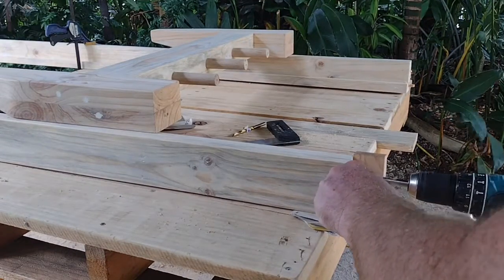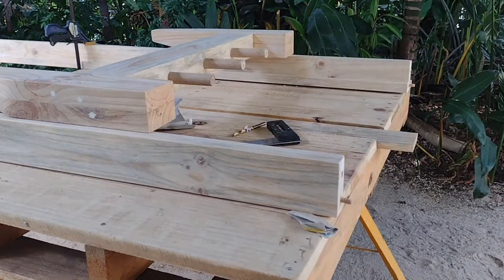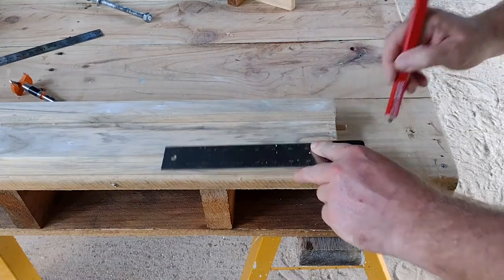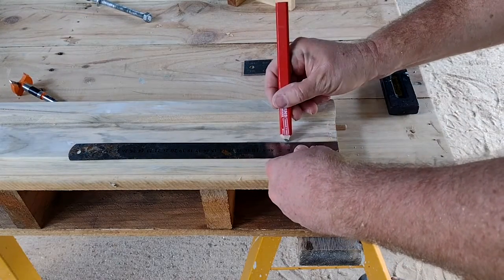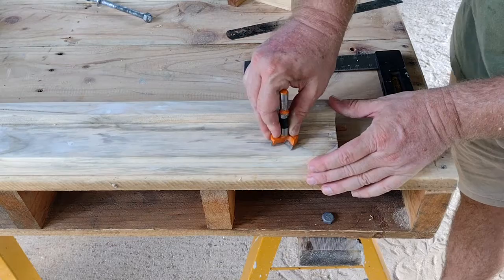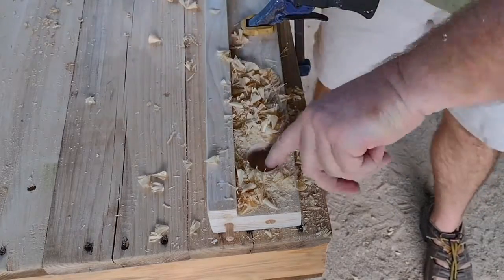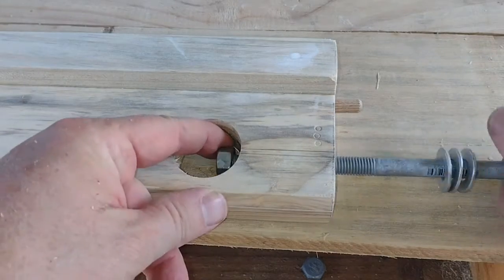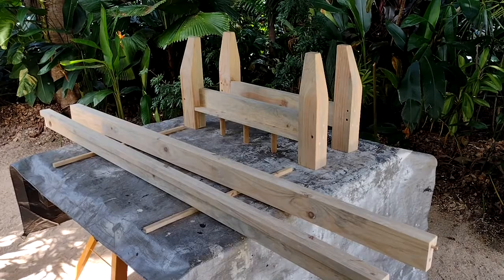Making sure that the bolt hole goes in deep enough to accommodate the whole bolt in each end of the rail. The bolt can now go into the rail, but we still need to be able to access the nut. I'm measuring out a good location to put a hole so we can access the nut to connect the nut and bolt, and by doing that connect the rail and the ends of the bed. There's a bit of tape around the bit to make sure I don't drill too deeply or through the rail. By doing this method we can both assemble and disassemble the rails from the bed ends for transport anytime we want. In the next episode we'll finish this off and put everything together - thanks for watching.